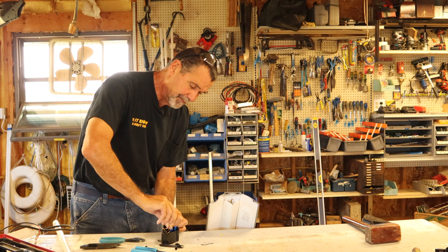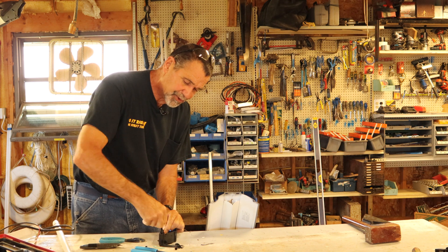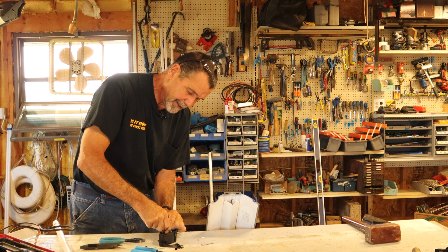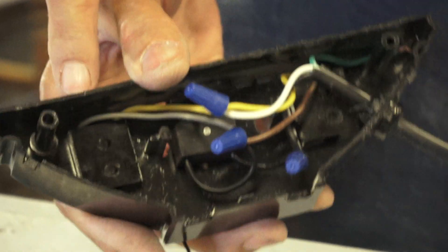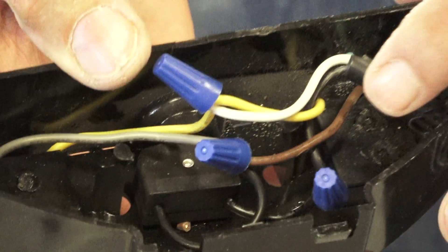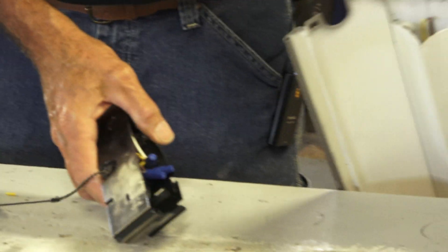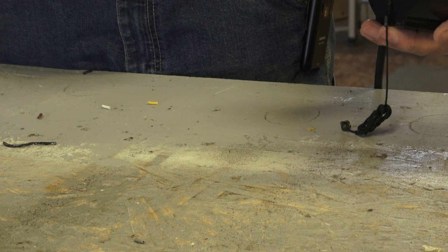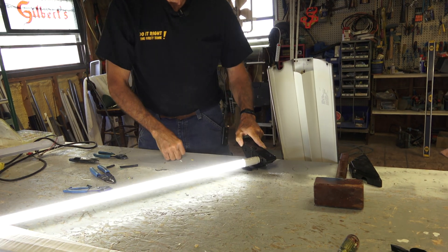The white is never switched. The white wire comes in and goes to each of the tombstones unswitched. So when you plug it in, the white — which is the neutral, your safe or neutral wire — goes to one contact on each end. The black goes to the other contact on each end, and the black also goes through the switch. Even though this bulb says L and N, we don't have to follow that.